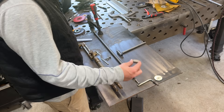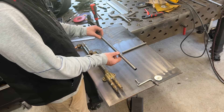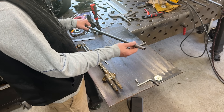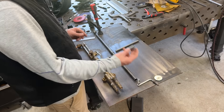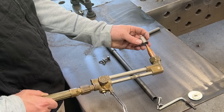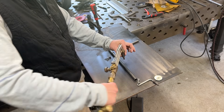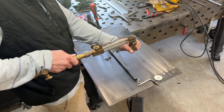Now for the circle cutter. This is going to be the end of my overall shaft - this piece of half-inch ID tube. The only reason I picked this one is because this piece right here slides right over the top of it and seems pretty smooth, though I might have to keep it greased. This is the piece of solid stock - it'll get cut much shorter to match the distance and offset. The torch will sit in this five-eighths-ID piece, which fits exactly around the torch head. I want to actually feel that torch pivot a little bit, so as long as you've got a little bit of angle tension it shouldn't be easy to pull out. We'll have a set screw on here too.